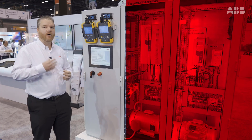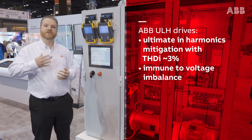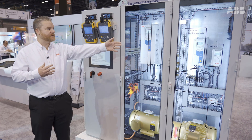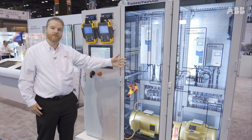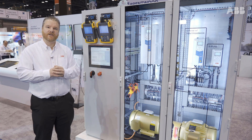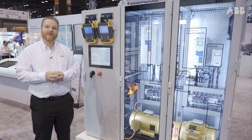If you're looking for the ultimate in harmonic mitigation, the ultra-low harmonic drive is that solution. It's an active front-end drive that is very immune to things like voltage imbalances, and it's able to boost voltage if you have a low-line situation — there are many other advantages beyond just harmonics. Overall, you've got your six-pulse drives with no impedance, six-pulse drives with internal impedance, external solutions like extra reactors and passive filters, but the ultra-low harmonic drive is the top choice if you have any harmonic concerns at all. If you have any questions, feel free to reach out to a local ABB representative or the ABB factory. Thank you.